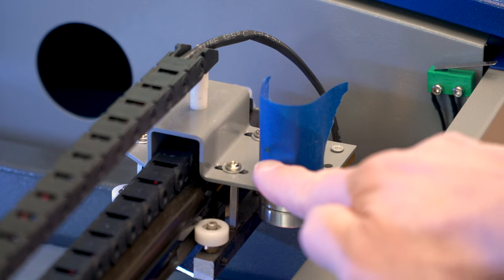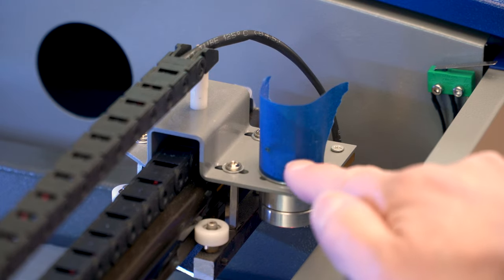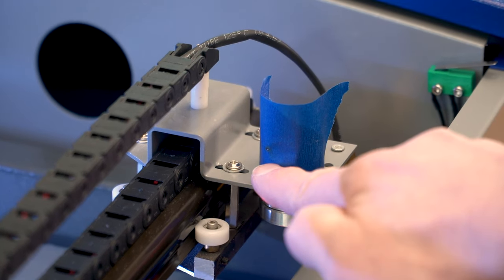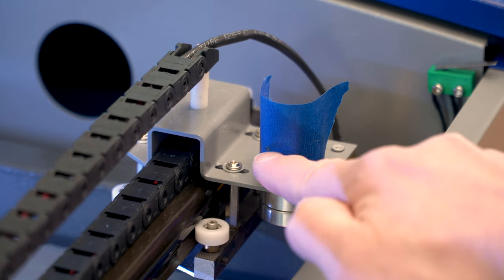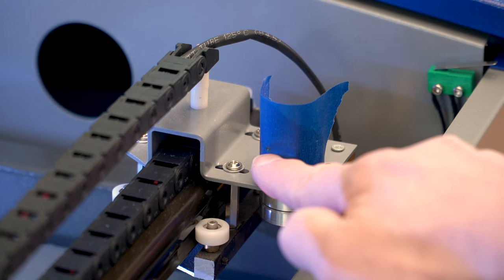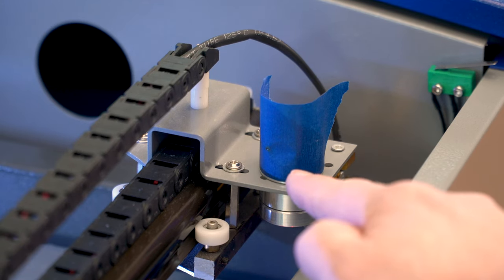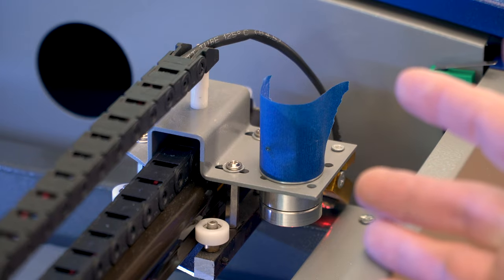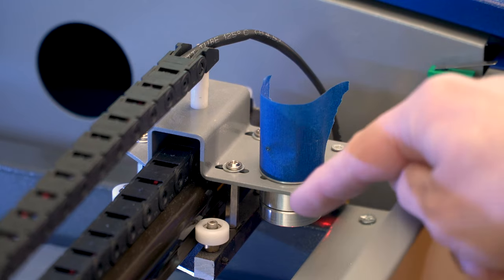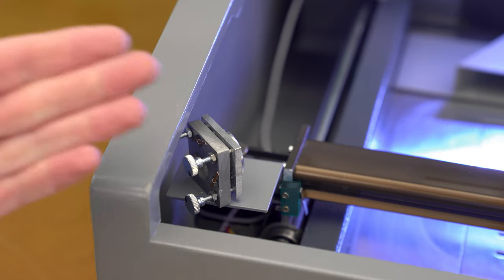Here's the first test mark we had. One of the neat things about using this tape with the tin foil behind it is I can rub over the top and see an imprint of the access hole on the laser head module. I can see that the first mark is heading off to the edge — not even over that access hole — and I can't see the second mark from this position, which means that laser beam wasn't even hitting anywhere near this laser head.